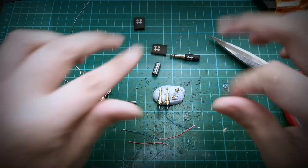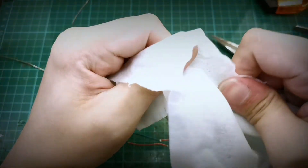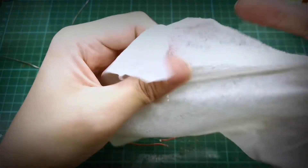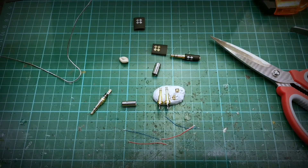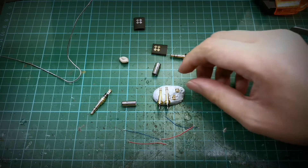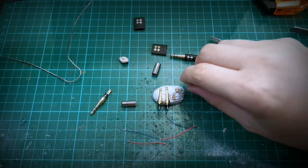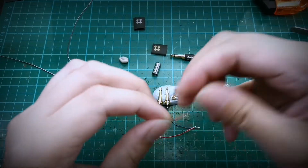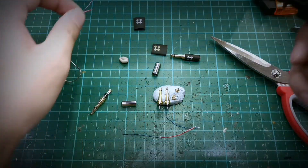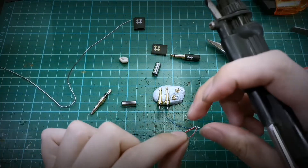After we mix, we want to get a wet wipe because the epoxy will get in between your fingerprints and you will have a very sticky situation. So what we want to do is install the wires on the MMCX first, not on the connector. We'll start by soldering them — it's quite easy. It might be small but it's not a difficult task.